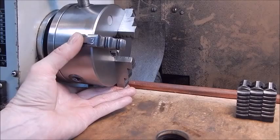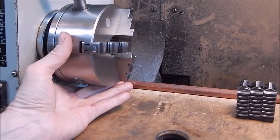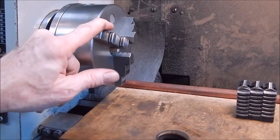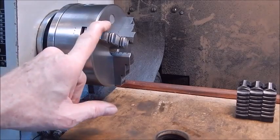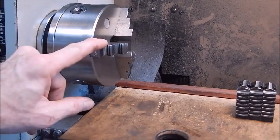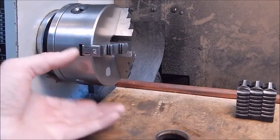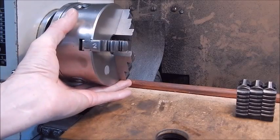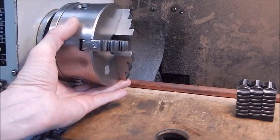Make sure the other two are pushed in, then turn the key clockwise — there you go, easy as that. They'll pull into position dead even and everything will be totally uniform. That's the way you have to do it; if you try any other way you'll have trouble — one jaw not coming in far enough or whatever. Easy peasy. Always remember: number one has to engage first, anti-clockwise with the key until number one snaps into place, make sure the other two are in, then go clockwise and it will pull up every time.